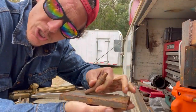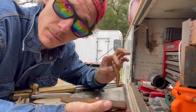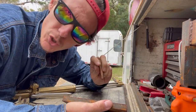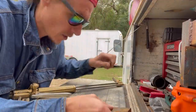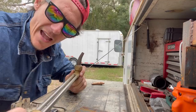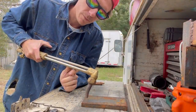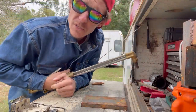You get your torch and you press your oxygen and go ahead and blow that line out. Now it takes a little bit of skill to do this — I still myself have not mastered this. I'm pretty decent at cutting with a torch, but this one's a little tricky. So you definitely want to get some practice pieces before you start cutting on a customer's piece of equipment. Right here is my Victor that I keep set up with the scarfing tip. As you can see I've got it sideways, and you can loosen the nut and twist it any which way you want. Then I'll get down in there, light my torch up, heat it up, and blow the material right out of the way.